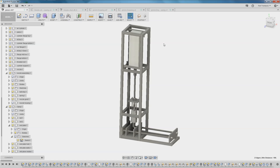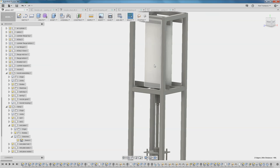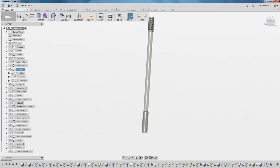The frame is made of construction steel, 30 mm square profile and 3 mm wall. On the top is a 125 mm bore, 300 mm stroke air cylinder. The plunger is connected by a custom nut made to match the cylinder and plunger threads. The plunger in the middle is thinner than the end which pushes the plastic — it helps reduce friction on the barrel and allows for slight misalignment of the plunger.